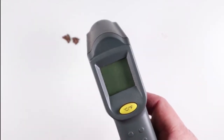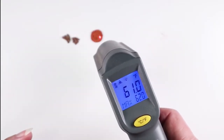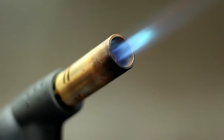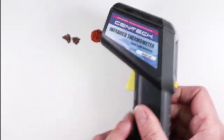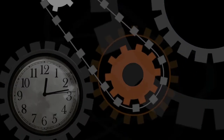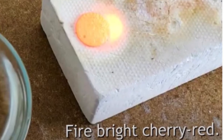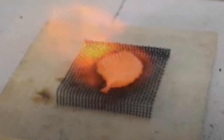One thing that I did find helpful was to use an infrared thermometer to check the actual temperature of the piece while firing it, which I brought up to the temperatures the directions said — around 900 to 950 degrees — because much like curing polymer clay it needs to be held at a certain temperature for a certain amount of time in order for the particles to bond. So knowing what the piece looks like at the correct firing temperature gave me a very clear idea of the color I needed to hold it at.